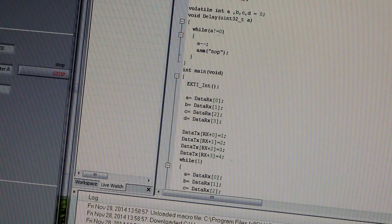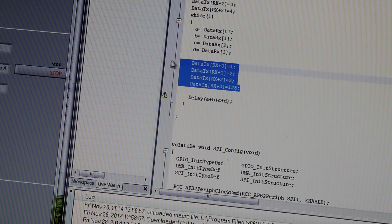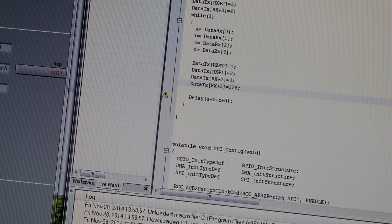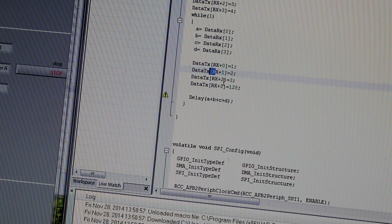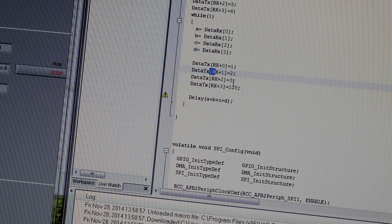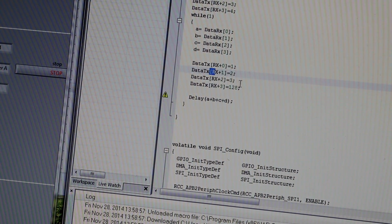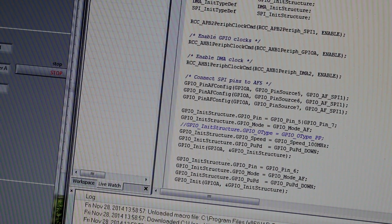And you see how difficult it is to write programs. So this is everything we need for reading data and for sending data. It cannot be simpler. And of course, there is only one problem. If you have a large variable like 32 bits, we need to assemble it from 4 numbers, and it is possible to write to this number and read it, and we will get corruption. So basically, we have 2 bytes from one transmission and 2 bytes from the second transmission. If data is changing very rapidly, we will get errors. But we can fix it with a simple CRC. But for now, it will work. So let's make something useful. I'm going to write a program for transmitting the temperature of the die to LabVIEW and showing it in a graph.